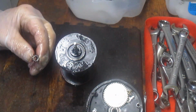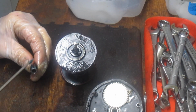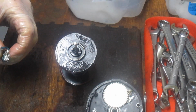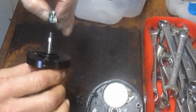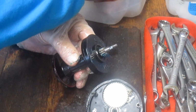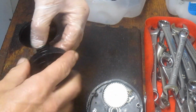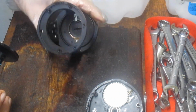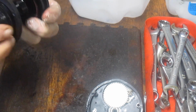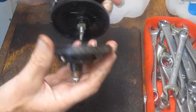And then to reassemble then, I'm going to take that spool gear as I mentioned. I'm coming the other way now. I find it's easier for me to put the spool gear into the holder. I'm just putting some grease onto the gear. I find it's easier for me to load this in here and then grab that pin, get that into the back of the axle shaft, and then that pin is going to go into the crossbar there. You've got to kind of eyeball it, but eventually you get it. There we go, we're in with that. And then I can take the top assembly and mate the two.